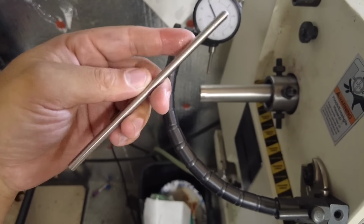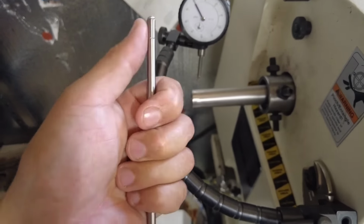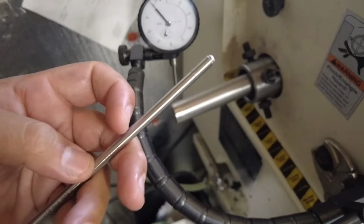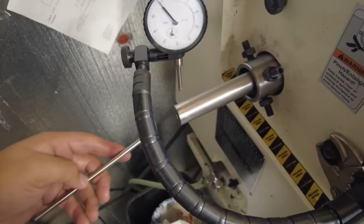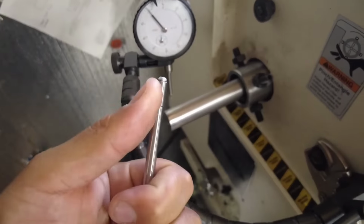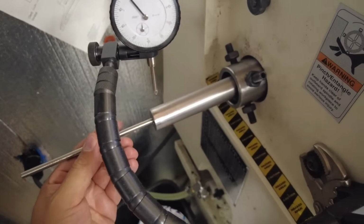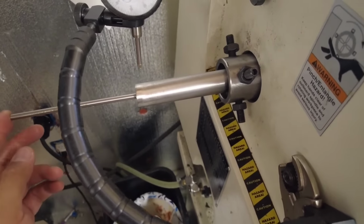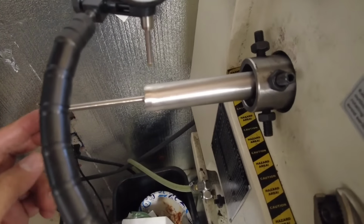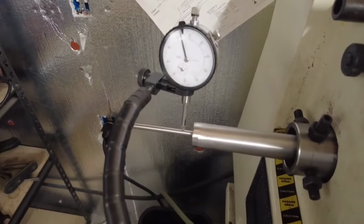This tool here is called a range rod. Now there is a Grizzly rod and a range rod. The range rod is a tapered rod, which will stop. Like I said, it's tapered. It'll stop on the part where it starts to hit the lands and grooves. It is a piloted tool, very precision ground. And this is, in my opinion, what it's supposed to be used for. A lot of folks, from what I've seen, use this as an indicator for the actual chamber itself.